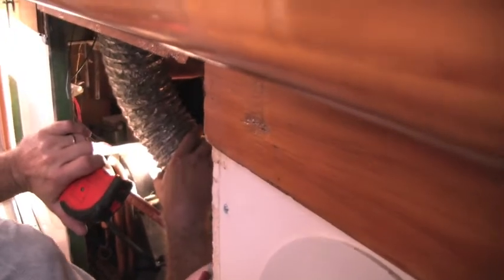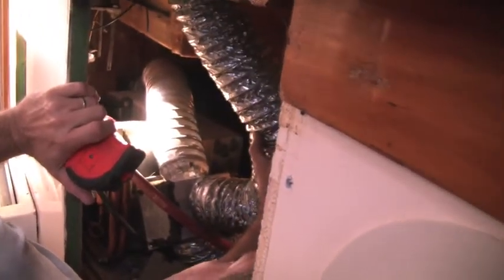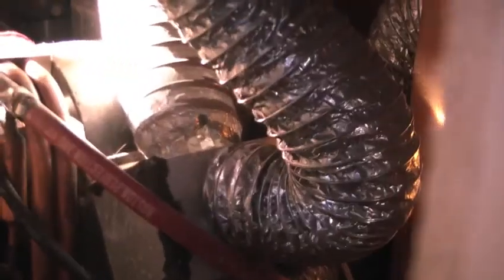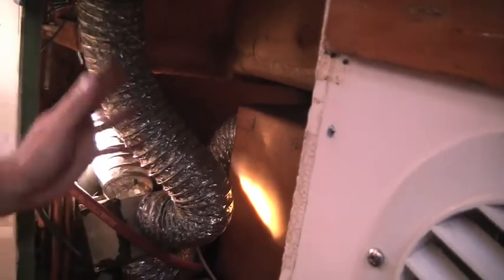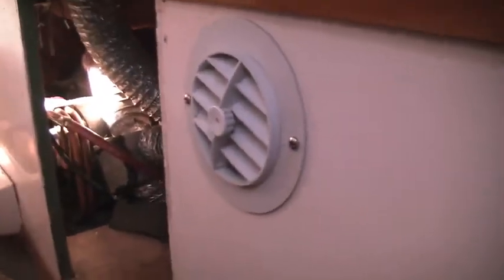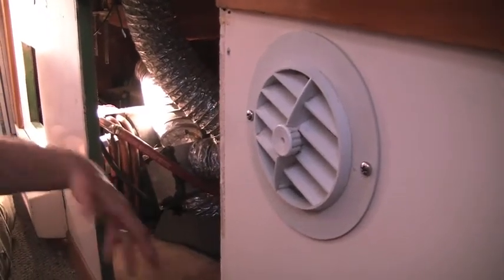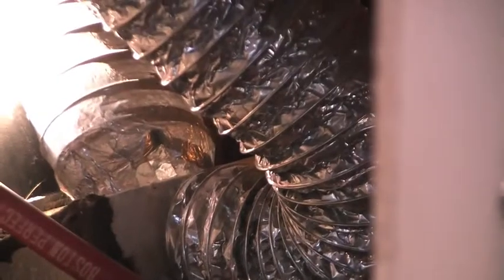There's tons of room in there. What we do is set up what I'd call a free-blow air conditioning system — each evaporator has its own fan right on it and blows the air out directly. You're not trying to push air through a duct, which is very inefficient. Every bend and all this corrugated ducting stirs up the air and reduces the flow. The amount of air you get out of these vents is nothing compared to what that fan could put out if it was allowed to blow freely into a room. And as the air passes through all these vents, it picks up heat from inside compartments.